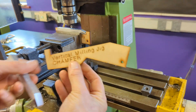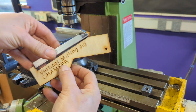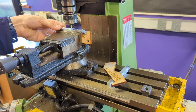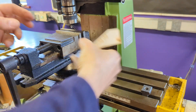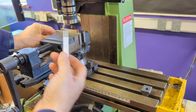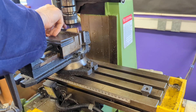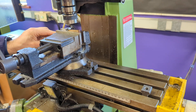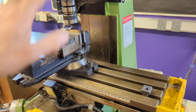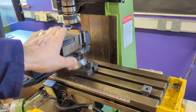When you're doing your sloping pieces that you need to mill, this jig here is designed to hold your material at the right angle. When you clamp this one into the vice, you're going to be using it like this - that piece goes in to the vice flat and your job sits at the correct angle, so that you machine your work at the angle we're after.